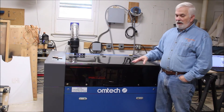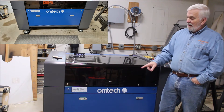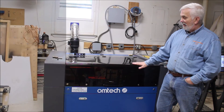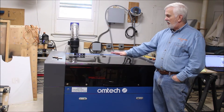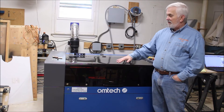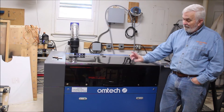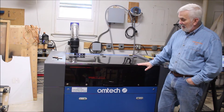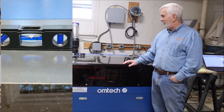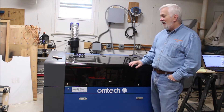My floor out here in the garage is really terrible as far as having slopes to it. So I used my CNC router and made these little pads to go under one side so I could get the machine level. It's not super critical that the machine itself be level — it's more important that the bed be level and parallel to the gantry. But I still wanted to get it level without having to crank out a whole bunch of threads on that side. I put those little pads on and you can see from the level here that I did manage to get the machine pretty level. Plus it helps so a pencil doesn't roll off.